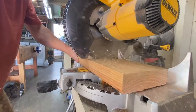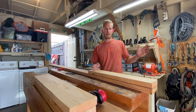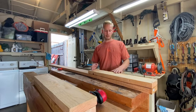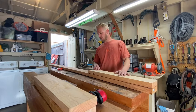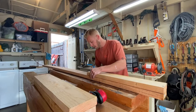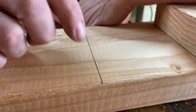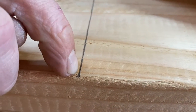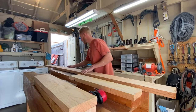To get accurate cuts on my miter saw — since I don't have a track with a stop lock — the best way I've found is to take the original piece that I cut and make all my markings off of that piece. I'll take my original piece of stock and line the butts up, then make a pencil line. When you're sawing, you want your saw blade to line up exactly on the left side of the pencil line — not in the middle, not on the other side.